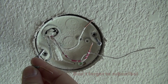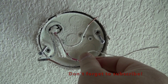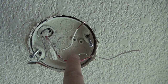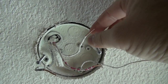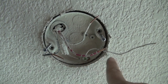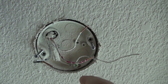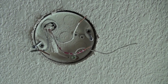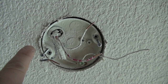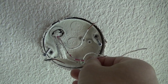If you were to install a ceiling fan, you would hook the black wire to the fan motor and the other wire to the fan's light fixture, with all the neutral returning to the white wire and the ground connected — it's usually a green wire. That's why there are four wires: they were anticipating a ceiling fan. In our case, our light fixture only has three wires, so I'm just going to connect the black and the neutral, and seal off the red wire since we don't need it.